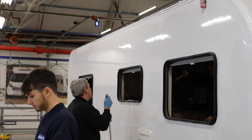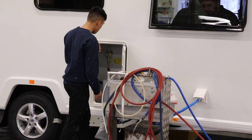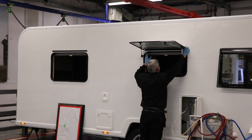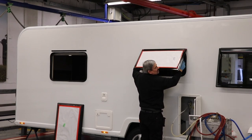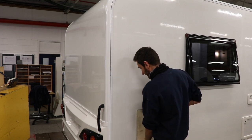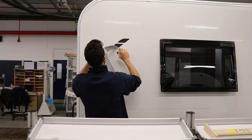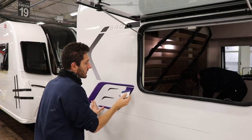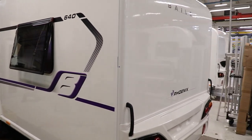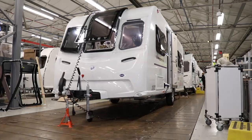Towards the end of this line, brackets are installed ready for the windows before the caravan is slid across onto the next stage, where all the caravan services and features are tested. This includes the water, gas, and electrics along with the battery charger and road lights. The windows are finally installed and the production line moves back in the opposite direction towards the end of the line. The external graphics are applied to the caravan, using a template for the correct position of the decals. The caravan now looks complete, but there are still jobs to do inside including the trim for the shelves and the cupboards.